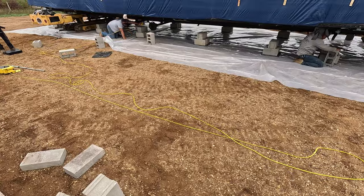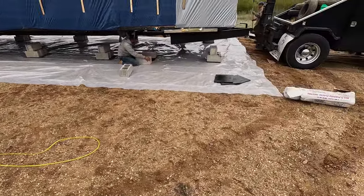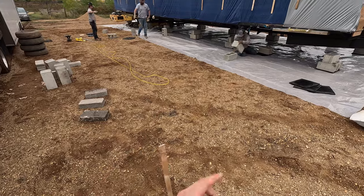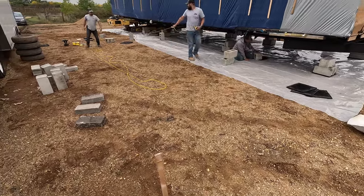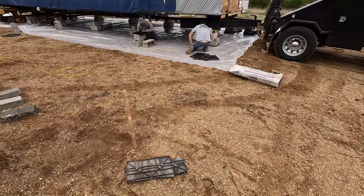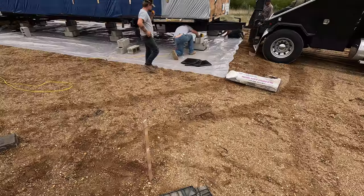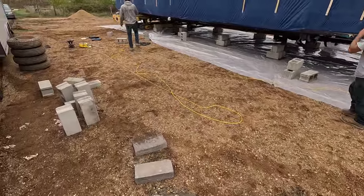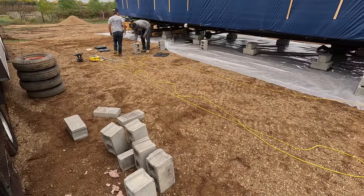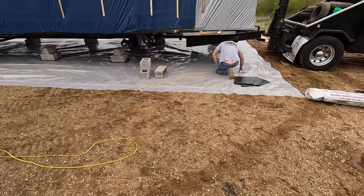The setting portion goes relatively quickly, especially when you've got quite a few guys. Those stacks get set up really fast, and we move basically as quick as we can, measuring each stack with his tool that he's carrying around there. He's going to holler out to these guys what he needs to build up on top of that stack, or whether we need some smaller blocks to lower that stack. With that tool, he basically takes a reference point — he starts with a zero near our translift, typically, and then goes along and zeros at each one of these other stacks. We use wood.